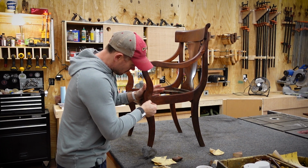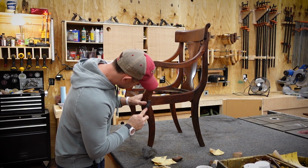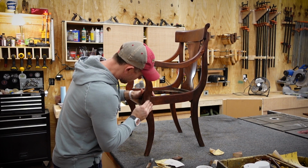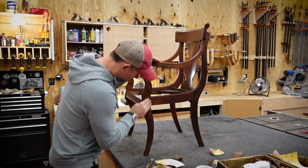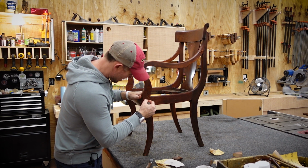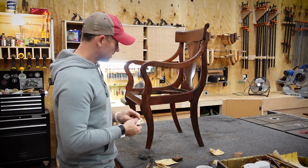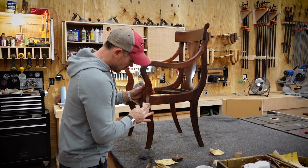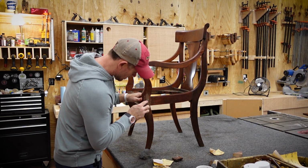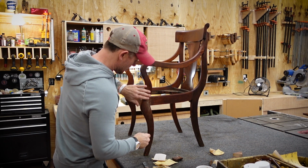And sometimes you can get it off with a fingernail or a flat blade if you're careful. You don't want to gouge or scratch the surface, but you can sometimes get in here. And as a matter of fact, let's make sure this blade is nice and flat before we get too much into this. And again, I'm just feeling this to make sure that I'm taking off glue residue and not finish, because the two tend to blend into one another. Now, if I had to get aggressive, I'll show you for example's sake, I wouldn't recommend doing this yourself. You can take a piece of sandpaper if you absolutely had to and sand this slightly, and you'll start to see where the glue is there. But again, I wouldn't recommend doing that unless you're really good with replacing your finishes. So, all right, that's good.